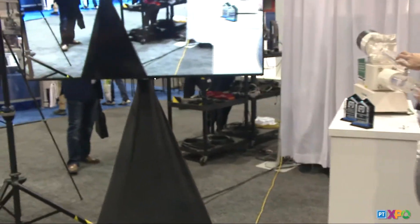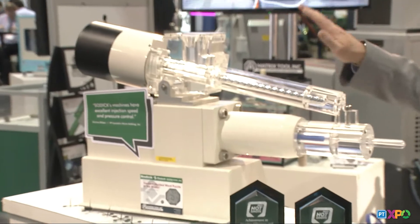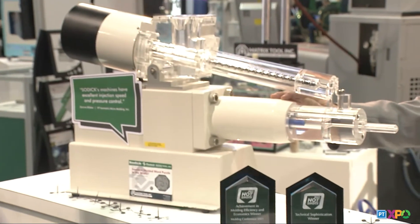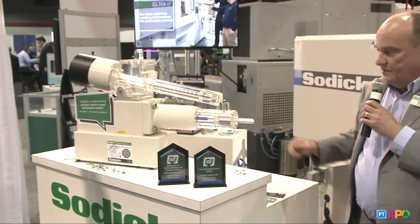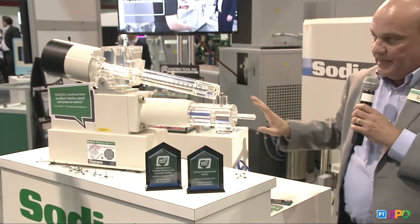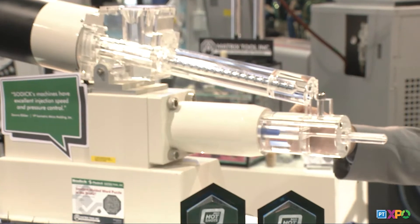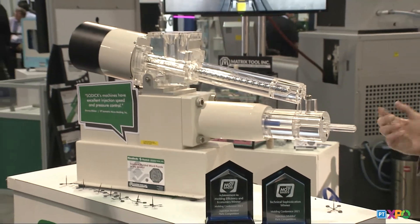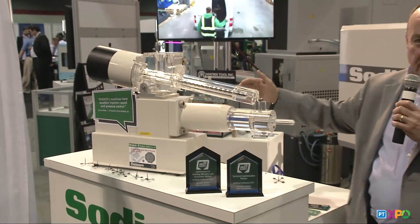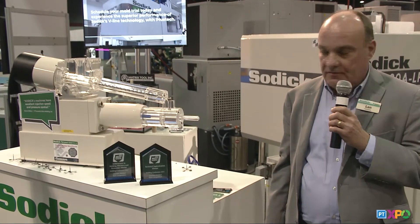Here's a little mock-up that we use, which really shows you the inner workings of the SODIC injection unit. Basically, we're separating plasticizing from dosing — we're not trying to melt and prepare material to shoot with a single screw and a check ring. This is an extruder screw, it's a stationary screw, and the material is molten. The material actually pushes the plunger back to an exact set position by the high-resolution encoder. When the dose is filled, the screw stops turning and shuts off — you have a positive shutoff like a needle valve on the screw side. When you inject with the plunger, you don't have any leak back on the screw side, and there's a very tight tolerance between the plunger head and the barrel, so no leak behind the plunger as well.